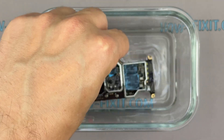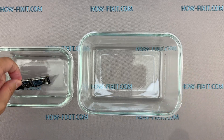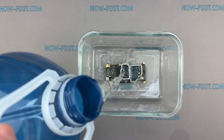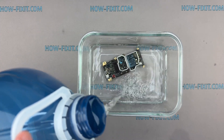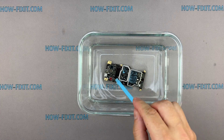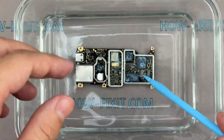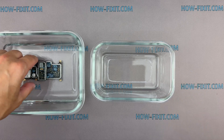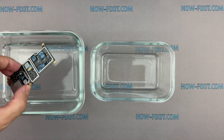After this step, we'll need to thoroughly rinse the board with distilled water to neutralize the vinegar. Never use tap water — it can leave behind even more mineral deposits. Keep in mind, vinegar is not a primary cleaning solution, but a backup option for severe corrosion that alcohol alone can't remove. And unless you follow up with proper rinsing and drying, vinegar can actually make things worse over time. So use it carefully and always as part of a full cleaning process.